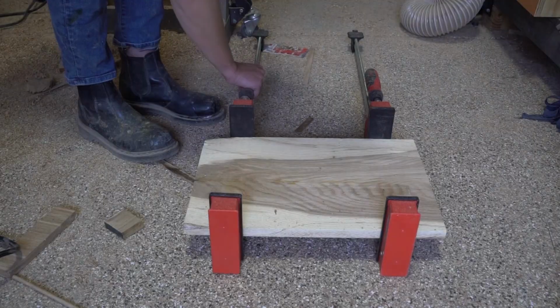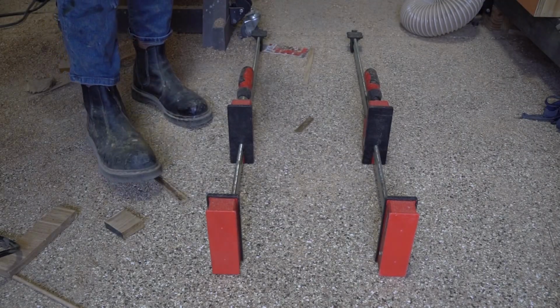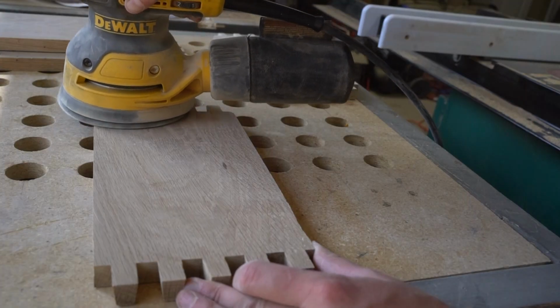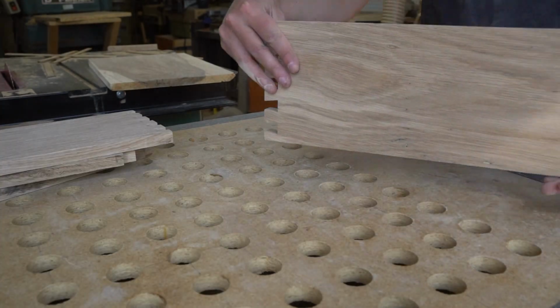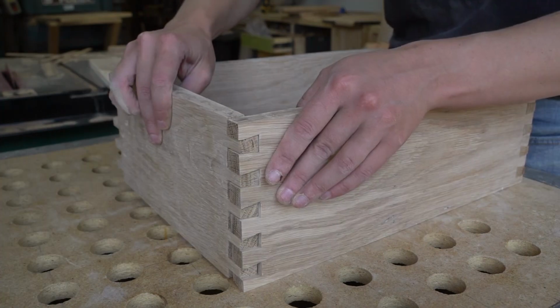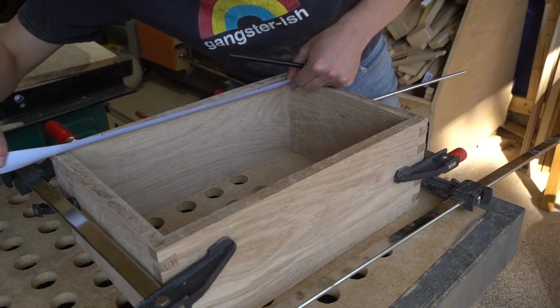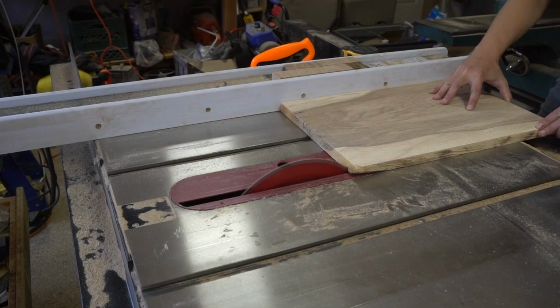With a good dry fit, I collected my cured top and bottom panels and gave everything a finishing level sand down. After that, I clamped the pieces together to get the exact interior dimensions of the box. Then used those and a little bit of benchtop math to cut the dimensions for the top and bottom panels.